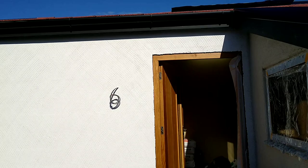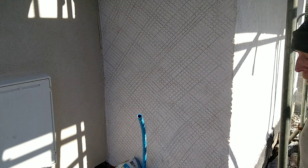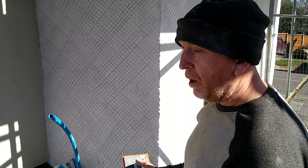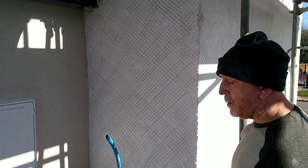If someone was interested in learning this Al, what would they do? How many hours are you looking at beyond the trial? Is it just a case of - if you can do a bit of sand and cement, could you pick this up quite quick? If you're good at getting thickness on the wall, confident in getting 10-15mm of material on - a lot of people fall short and go too thin. Also correct use of a wood feather edge. If you've got that experience just take it over - very easy. Just getting used to the setting times, and it's a little bit less stressful than sand and cement.